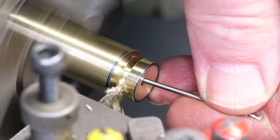So in terms of straightening the frame, when brass is worked, that is, it's hammered or rolled or bent by a mirror falling on it, for instance, it becomes work hardened. Now, this property has been used by clockmakers for centuries, for example, work hardening the teeth of wheels. But here we can see that the frame, where bent, has been stretched on one side and put in compression on the other. And you can see the brass is actually kind of puckered up.